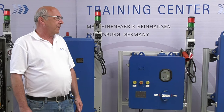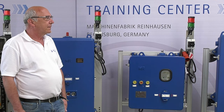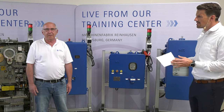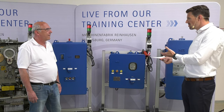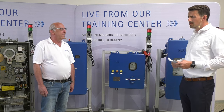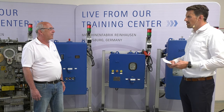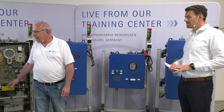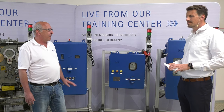So failure prevention, for example, can be a reason to replace older motor drive units with a new one. Failure prevention because of running through over the positions can be an issue. A leaky oil gear can be an issue. Also a technological upgrade, like mercury switches. I think the older ones are equipped with mercury switches, right? The MA2 and the MA4 were equipped with mercury switches. When they started with the MA7, it was out.